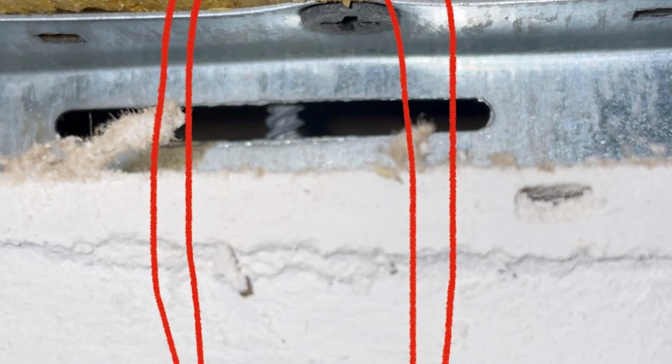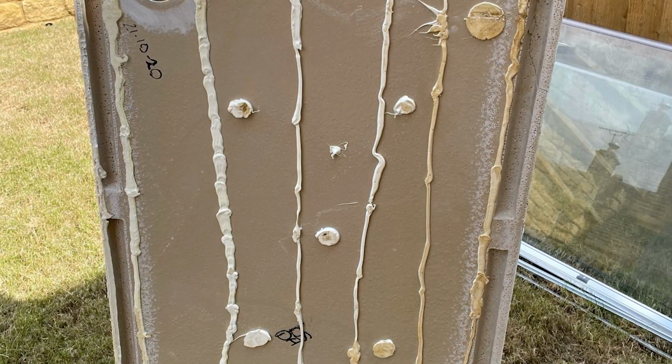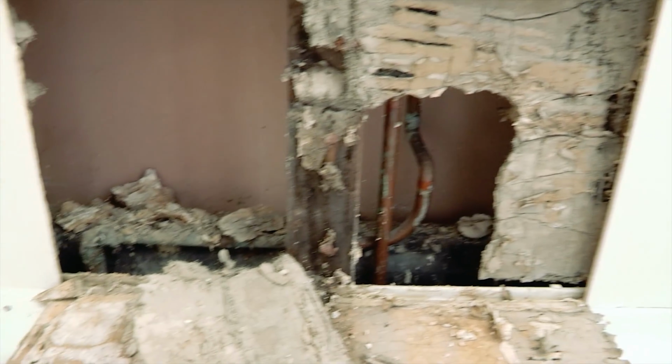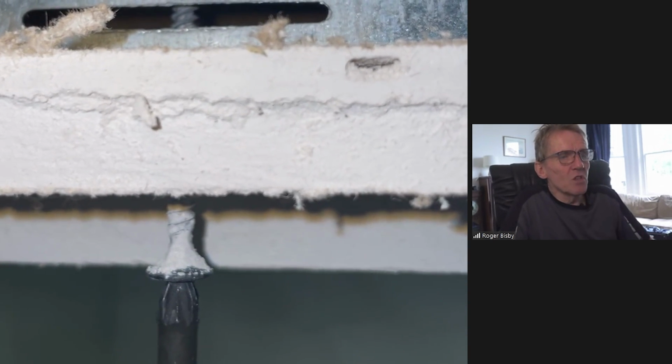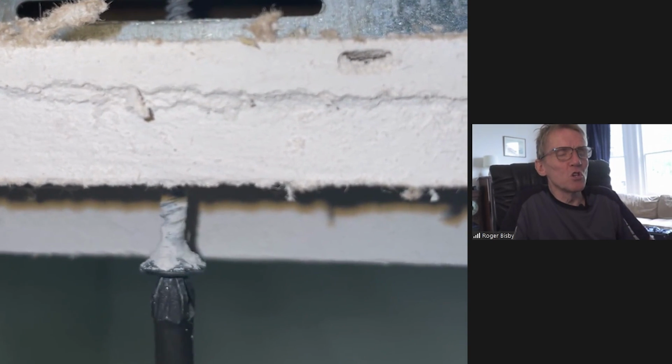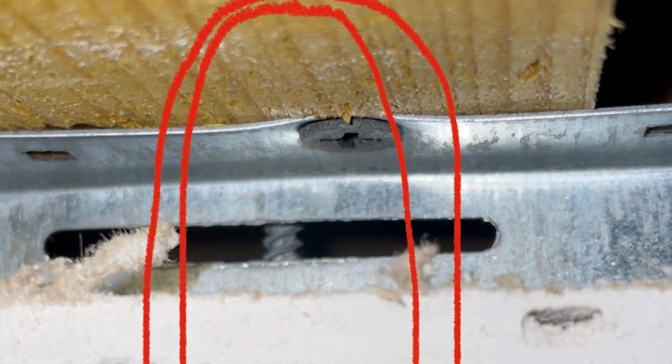So often what we're finding in these new build nightmares is that it's a small thing. We looked at a shower tray the other day that was put down on silicone inadequately and it cracked. We look at somebody not sealing round a shower tray, or not using a tile backer board. They're using plasterboard. They're not even using moisture resistant plasterboard. And then we get this, some guy who doesn't know what he's doing, sticking some big screws through because he's going, oh, well, I don't think those other ones will hold very well. I'll stick some big ones through. He's cocked the job up. It's another new build nightmare. And I don't know how Dan is going to solve that. I don't know whether the builders are going to solve it for him, but we'll get back to him and we'll find out if he's having any success with them. And if he's not, maybe we can wade in there. I'd love to have a go at them.